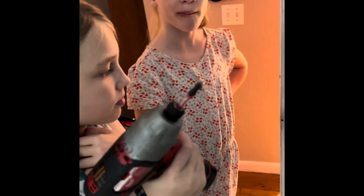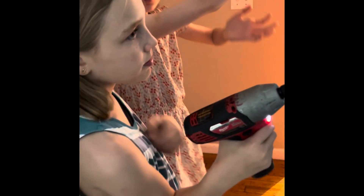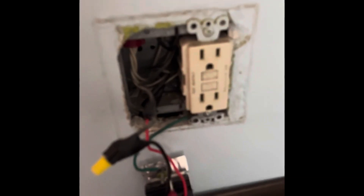I thought we had a dimmer. Well, it burns out - that's the one bad thing about dimmers, they do burn out over time. What was the first thing you did when you installed the last one? The first step was turn off all the lights and the breaker. Very good. Especially the breaker - that's important. Having the lights on might actually clue you that the breaker is not fully off.